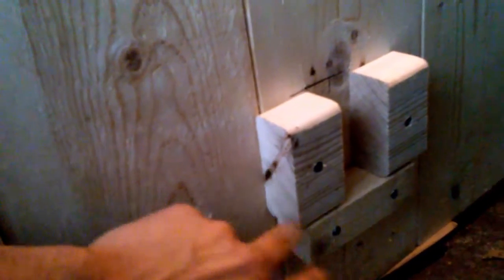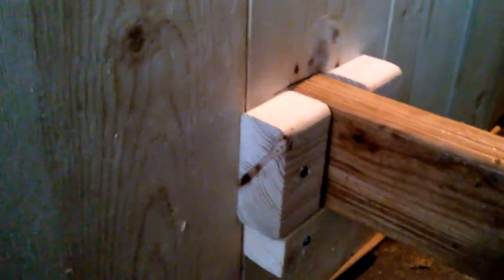On this notch system back here, it's pretty super easy. I laid a 2x4 all the way across, marked a straight line, and measured about 37 and a half inches as a center, so I centered that up. Then I left a two-inch gap there to give just a little bit of wiggle room so it's nice and easy to go in. Like I said, there'll be another one of these on the headboard that'll run all the way across and have a little leg going to the ground.